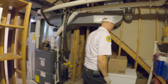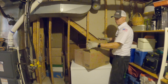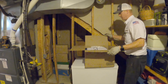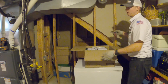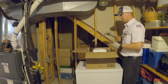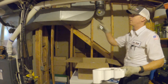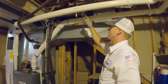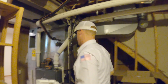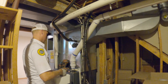Is there a reason why you want to replace the water line? Just treat it like a brand new install — this should be no different than a new install when there is no existing humidifier. On a new fresh install, we would run a new copper water line, so we'll just run a new copper water line here too. However, we will not need to install the saddle valve because there is a ball valve right there, which is a slightly better option than the saddle valve that comes with it. So we'll use that shutoff valve.